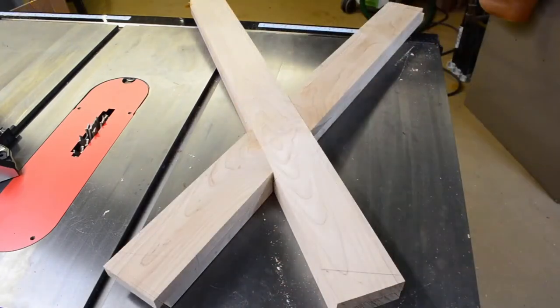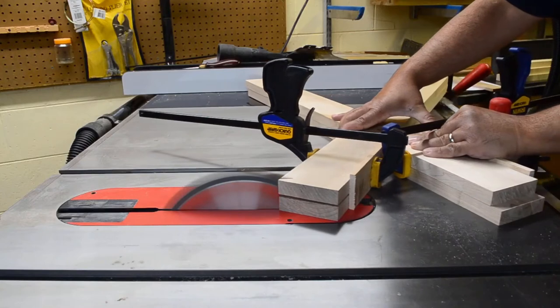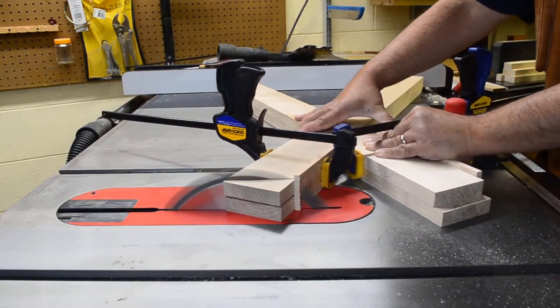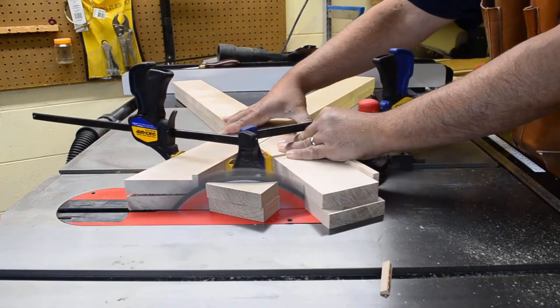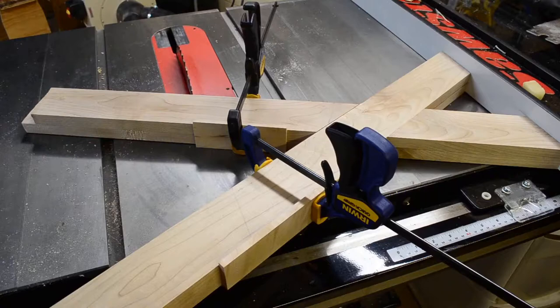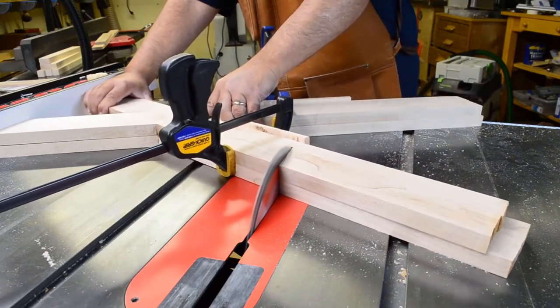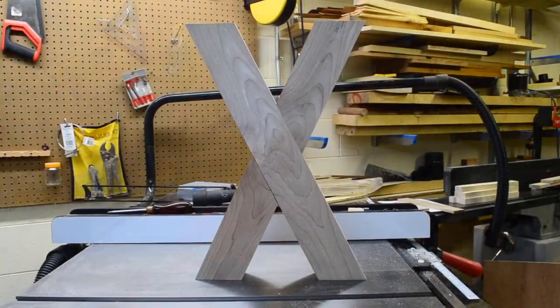Even while attempting to sneak up on the final cut, there's still just a little bit of play in this joint — but it's more than acceptable, and when placing the matching pair on top of each other, they're dead on. I deliberately left these leg blanks a little long with the intention of cutting them to the final length after the half lap was glued and assembled. So I set up my miter gauge to match the desired angle on the feet, and to help minimize any blowout from the cut, I even added sacrificial material to the back of each leg. After the first cut, I move the rip fence over to the desired length, butt the legs up against it, clamp more sacrificial material, and then make the final cut. Then once they're assembled and glued, they're a near perfect match.